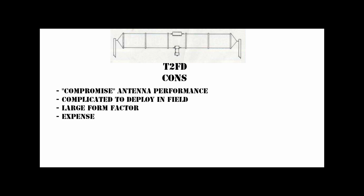The amount of end tension required to do this necessitated the use of ratchet straps. Now, center supporting the antenna on a rigid mast helped considerably, enabling the tension of trucker hitches and bank line to be sufficient to hold the antenna taut. Large form factor, stowed and deployed, this antenna takes up a lot of real estate. Although the antenna overall lengthwise is shorter than, say, an 80-meter doublet, it is really hard to tell. When aloft, the antenna really stands out, so if stealth is a consideration, another design would be worth looking at.